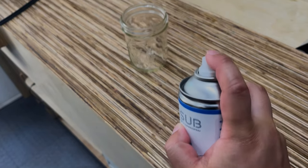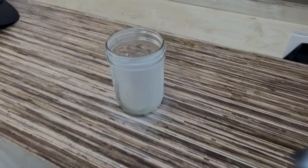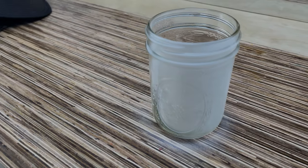The scanner also has difficulty scanning things that are transparent, like clear glasses, a glass window, a car windshield, or a glass cup, because the light and pattern just shoot right through the object. To solve that, they make 3D scanning spray — it's like a chalk spray that you apply to an object, and over time that chalk residue will disappear. There are other things you could do, like putting baby powder on an object.